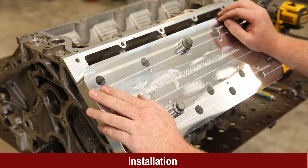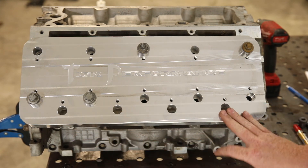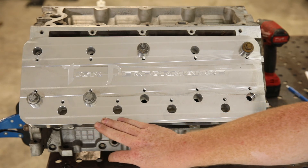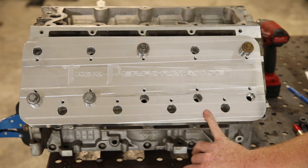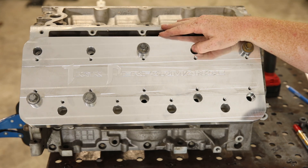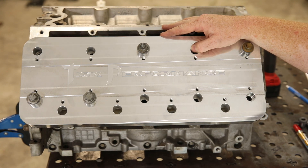And it's that simple. The four holes at the bottom of the fixture are not for Gen 3 or Gen 4 blocks — those are for aftermarket blocks with a six-bolt pattern, and they allow you to open them up from 8mm to 3/8 inch. Eight millimeter comes standard on the LSX block and RHS, and I believe on some of the Dart offerings as well. Thanks for watching. If you have any questions regarding this or any other products we manufacture, give us a call at 336-719-0599, visit tickperformance.com, or email support@tickperformance.com. We're always happy to help.